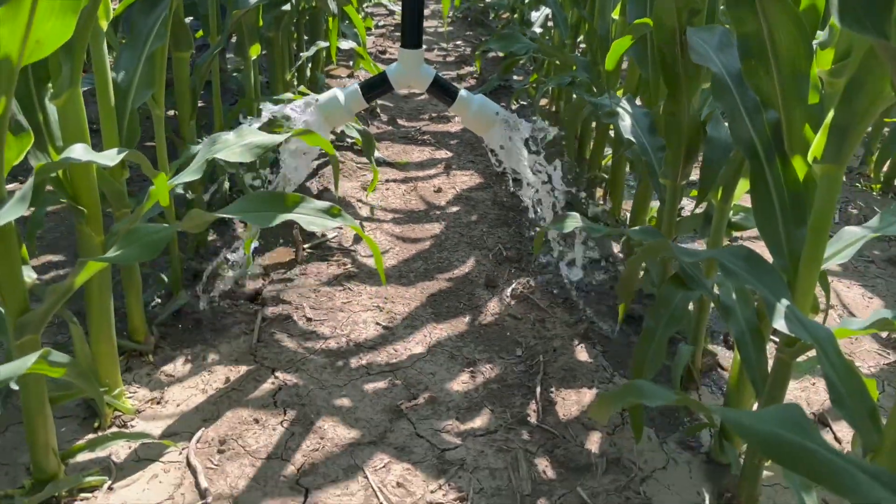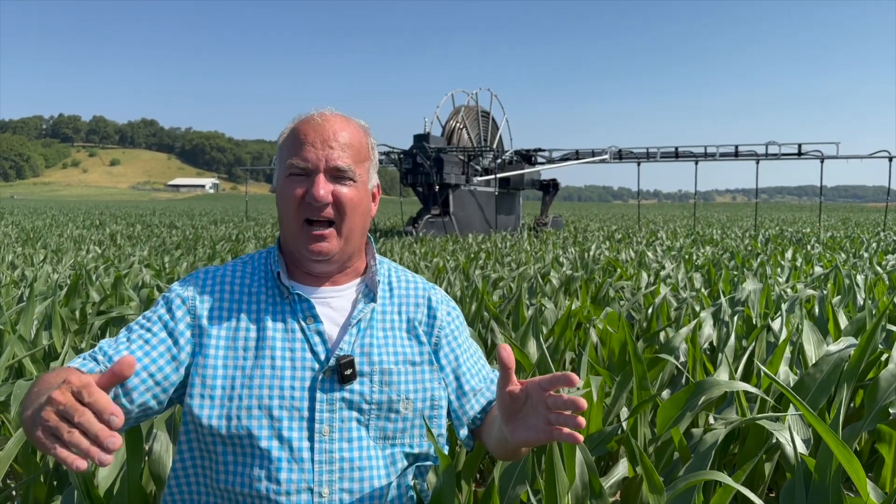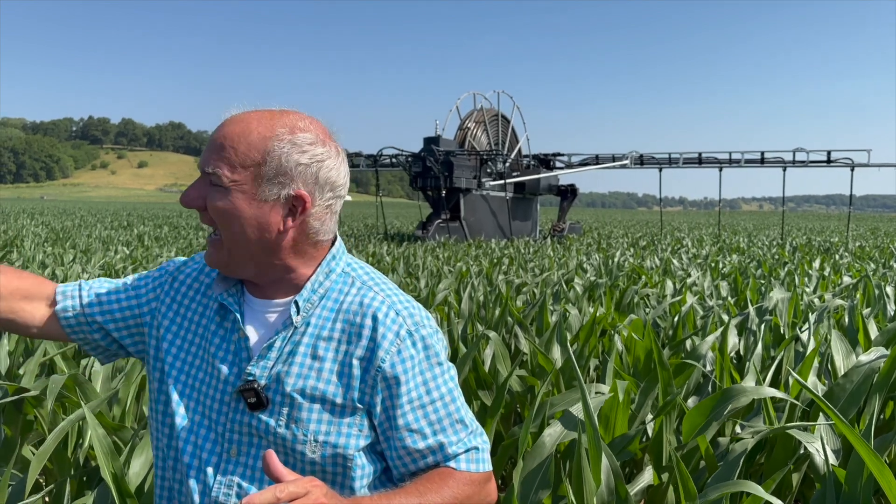We had to get to the point where it would work no matter what crop you plan. We're running on soybeans and corn and now on onions — a wide range of crops. But as you watch this machine behind me, it just literally thinks for itself. We're standing right here in the center of this 101-acre cornfield and it's now turning. It runs on a center — what we call the backbone. It's already done everything to the east side; now it's thinking for itself and it's going to run west. We're carrying 3,000 feet of hose, so this machine could cover well over 200 acres when fields are designed correctly.